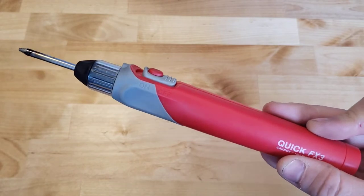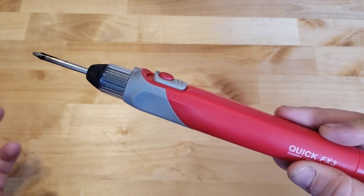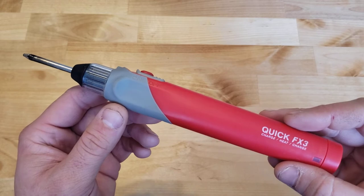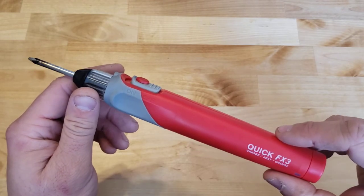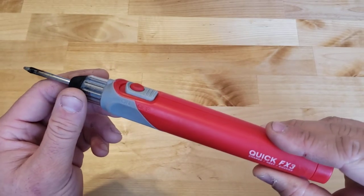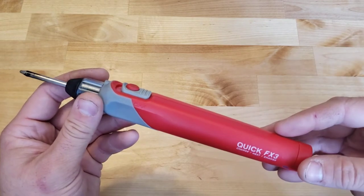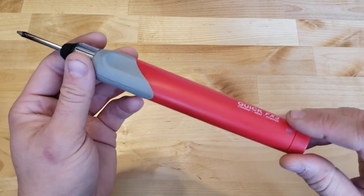So, upon first inspection, this is pretty basic. I think it is definitely a step up after using this for probably about a month or so daily use in my work as a 12-volt installer, so I'm soldering things all day long. It is definitely an improvement over butane, because there is no off-gassing from the side that's going to melt other wires, and it's definitely better than the AA sort of varieties in terms of heat-up time and convenience, because you don't have to keep buying all those AA batteries all the time.